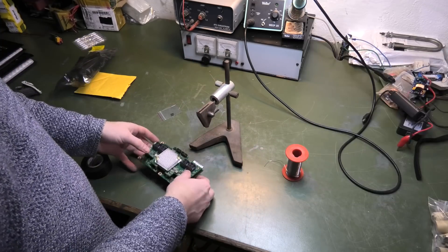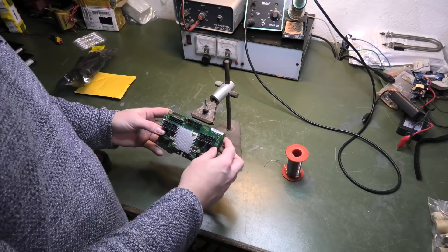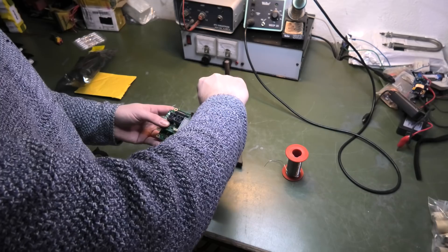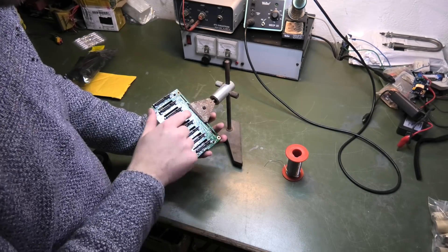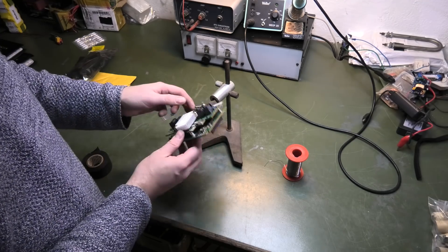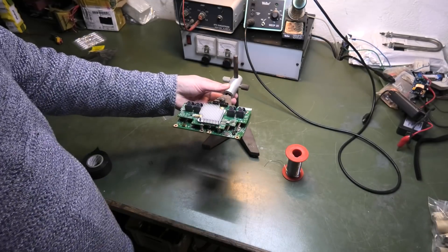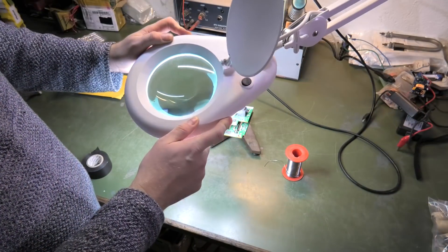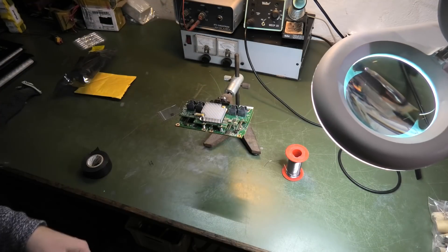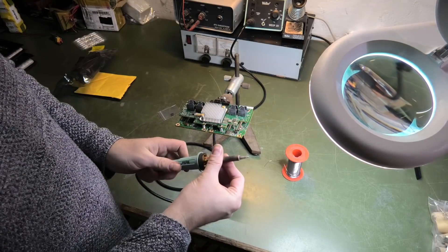I have this thing I made — it's really neat for holding a PCB. I just need to make sure I'm not crushing anything when I put it in there; that would be stupid — trying to repair something and crushing something else. You can see the tiniest little component on the other side that we don't want to break. Now I also need to change the soldering iron tip — last time I was doing battery banks and needed the big tip, but now I need the very pointy tip.